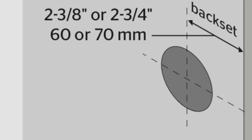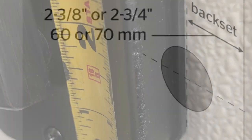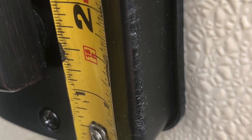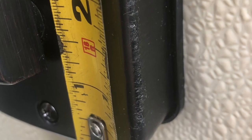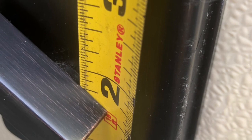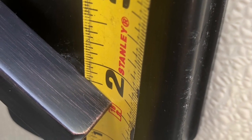If you don't want to do that, you can always take the inside unit and move it over a little bit to get the proper depth — you'll just have to trim the frame of the screen. When you do that, you also want to cut the screen so it can fold the opposite way. Now I'm going to get measurements for positioning the hole. I have to come up one and three-quarter inches from the horizontal frame of the door, but if I had to do it again I would come up two inches to give a little more room.